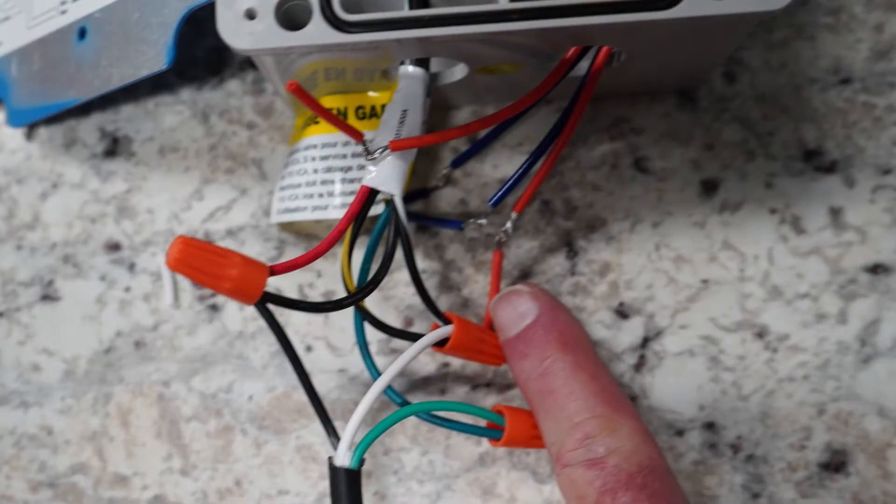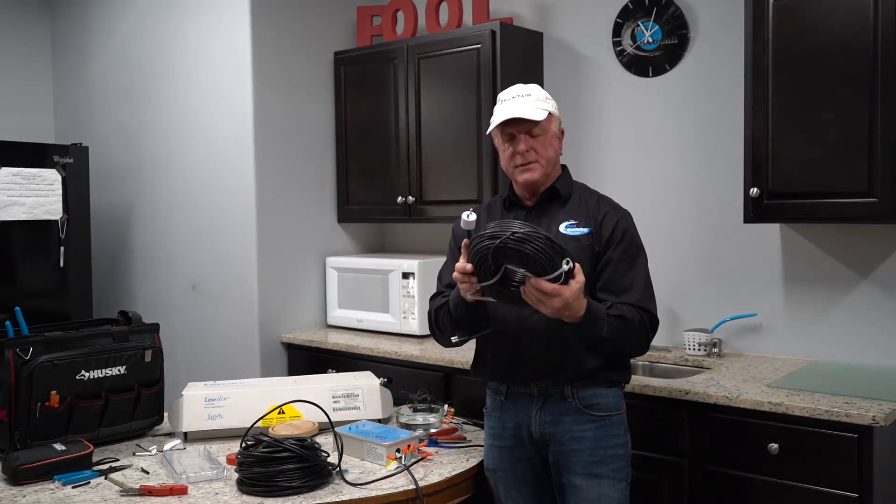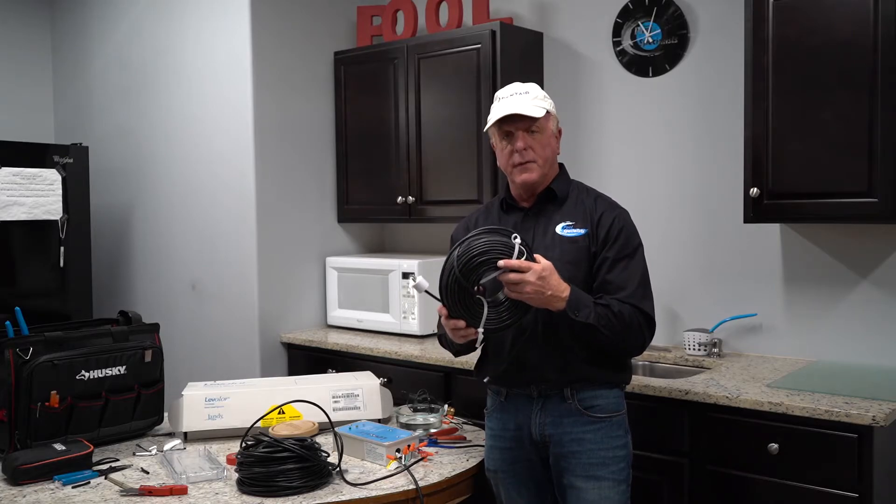Just for visual effect so that you can see it a little bit better — we made the connections outside of the box, but normally you would put a strain relief on the bottom of the box, clamp the wire to it, and the connections would be made inside the high voltage chamber inside the box. You'll notice that the green wire goes to green, the white wire goes to the black and white combined with the black and yellow, and then the black wire — the hot side — goes to the black, and sometimes it's a red wire or black and red.